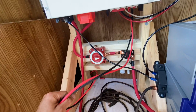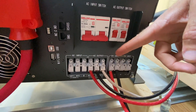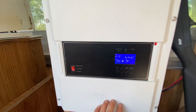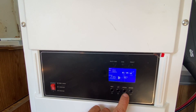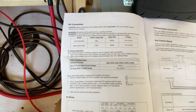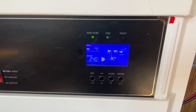The negative end and the positive end sneak through the wheel well right here. I've got these two solar cables and they run up into the Growatt. Underneath, you've got PV1 and PV2, each with a positive and negative. So you just run those two cables from the two sides of the solar array into PV1 positive and negative. On the Growatt display you can see I'm getting about 110 volts input from the PV array; PV input is currently four amps. In the user manual for the 12-kilowatt version, the typical maximum is 120 amps — 60 on PV1 and 60 on PV2. Since I'm getting four amps now and I know I can typically get six amps with full sun, I could scale this system up massively from where I'm at.